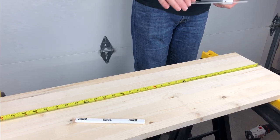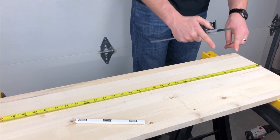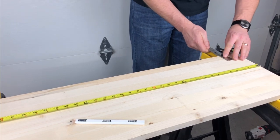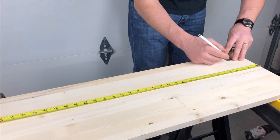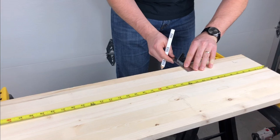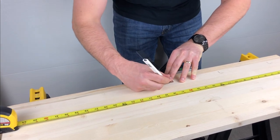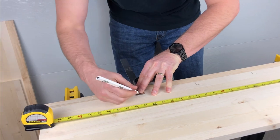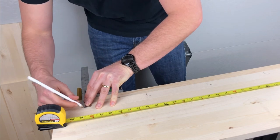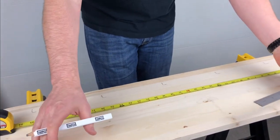You're going to want a sliding square ruler — we'll have a link in the description box for you to find that. After you've lined up where the holes go, mark two inches in. Set your sliding square ruler to two inches and mark an L-shape around the end at each mark. The first one is three inches in, then continue making little L-shapes all the way down. After you finish one side, do the same thing on the other side.